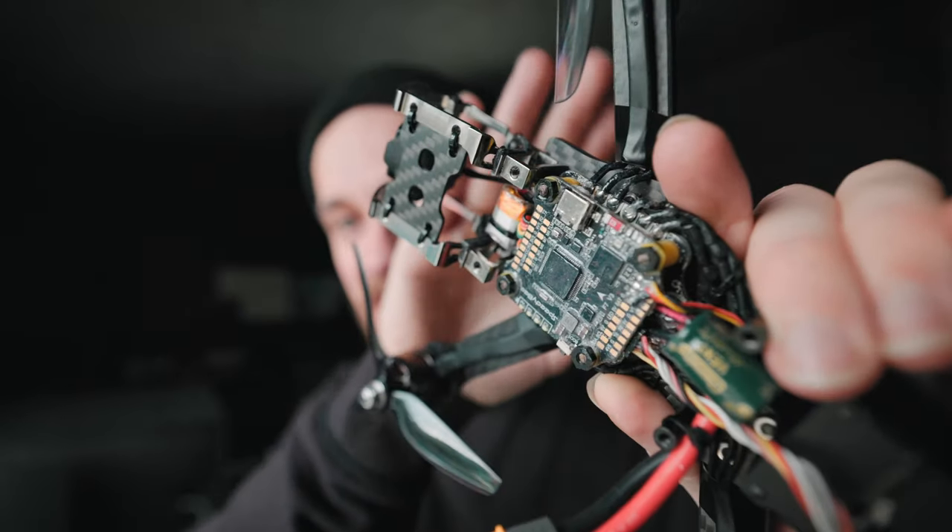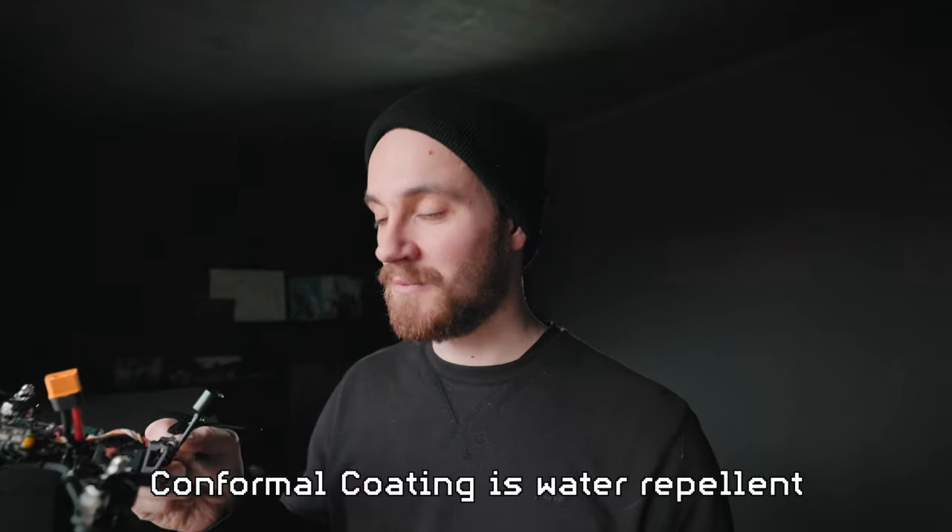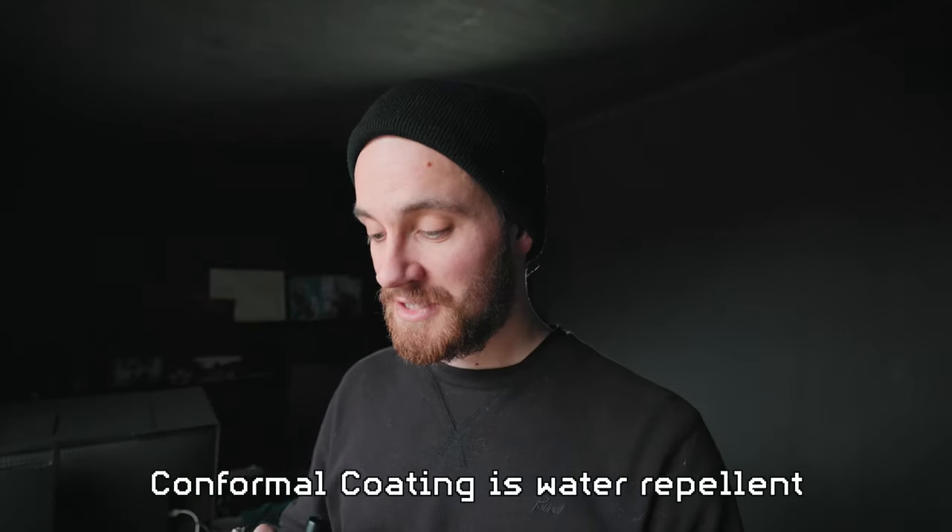As you can see, it has a nice glazed finish — that's because I applied conformal coating to it. I live in the Netherlands and it rains a lot, so there's always water somewhere: puddles, wet grass, mud. It's very likely that when it crashes it will be a little bit moist, so I applied conformal coating so it won't fry as easily.